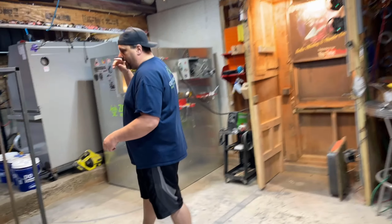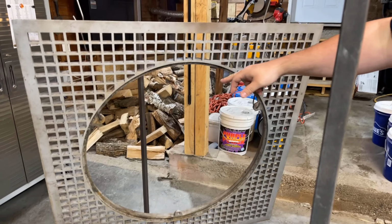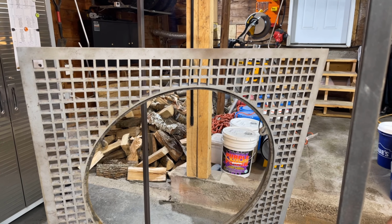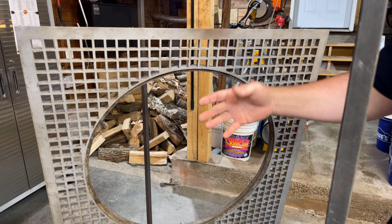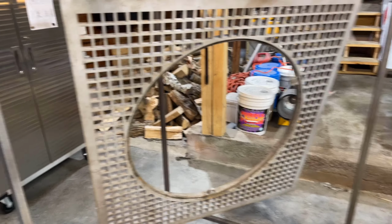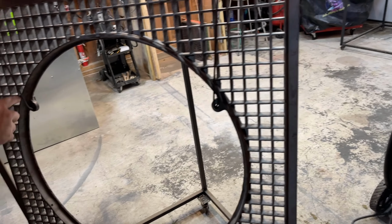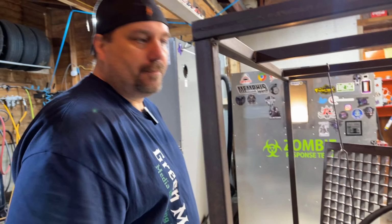I actually readjusted this. When you're adjusting things, make sure your hooks aren't laying up against something because it'll make a void. I know we may have a slight void in here, but that's fine because the grate center cover comes over this, so I'm not so worried about that. And on the back, I'm going to have a void just in my corners here. Let's see where we go from here.